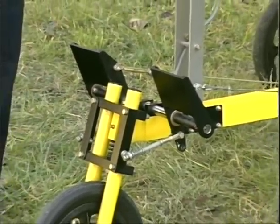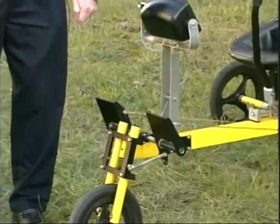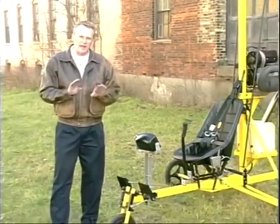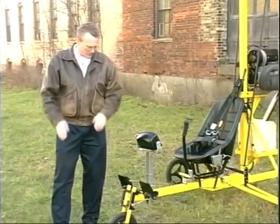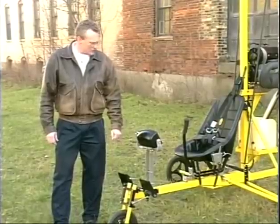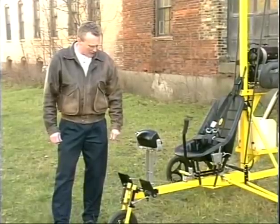Now, in addition to that, we've also gone to some direct rods and links to the nose gear. In doing that, it gives one a very good feel of the craft while it's on the ground, and at the same time gives you some play as you begin to correct for both P factor as well as airspeed while you're on the runway. And it gives you a very good feel of the aircraft.